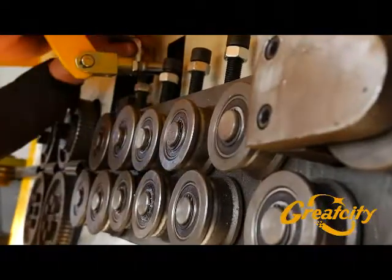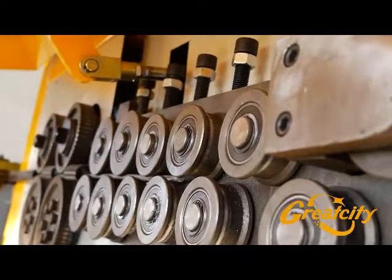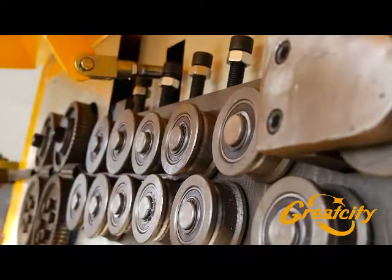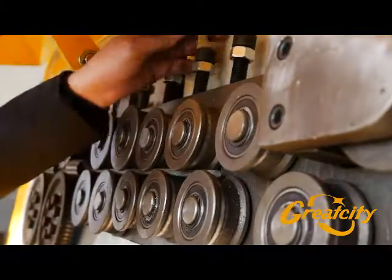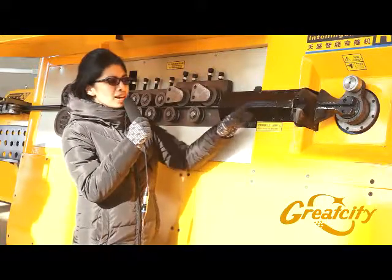Press the knob to tighten the wheel close to the wire, then tighten the wheel from the feeding part. The wire is now moving forward, controlled by a button on the screen. Turn the first black button on the left side to the right so the wire moves forward between the five pairs of wheels. The lower part wheel where the wire is received has to be tightened using the screw in the upper part.